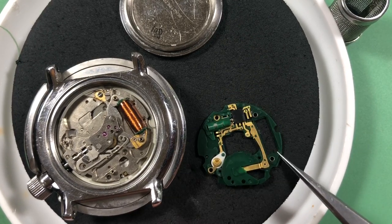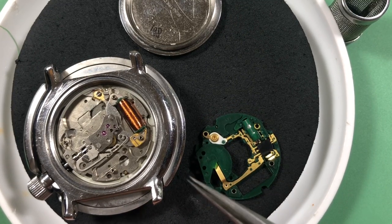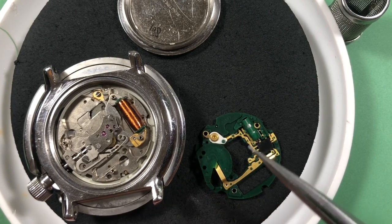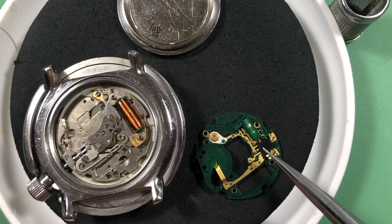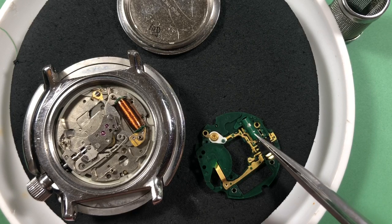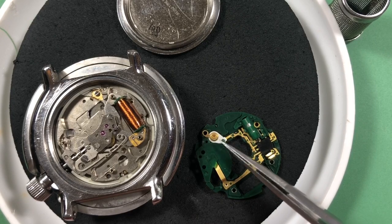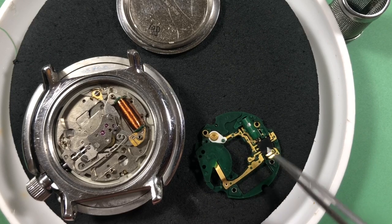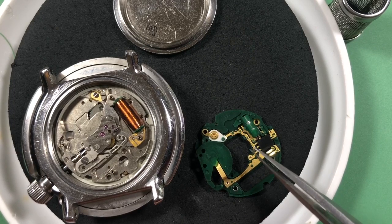This is the underside of your circuit. What's nice about seeing this is, again, how clean it is. Because these watches, being divers and heavily worked, tended to have battery leaks. And then you get this white acid crystals everywhere, and they tend to really move into those. They'll sort of grow inside the CMOS, which is right here. So you've got the crystal here. That's the vibrating crystal that the quartz times with. This is the CMOS, the variable timer. And the acid will get into all this stuff and then it kills the circuit. Sometimes I can bring it back, but often I can't. But this one's so nice and clean.